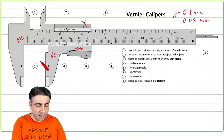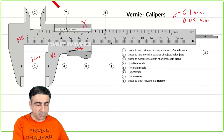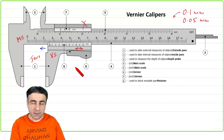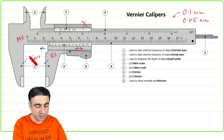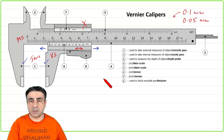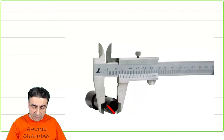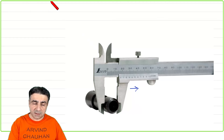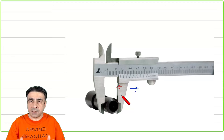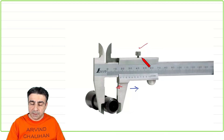These jaws — when you slide the Vernier scale to the left, the jaws are going to close and the gap between them will become zero when the two jaw tips touch. If you move it to the right, the jaws expand and you fit in the object you want to measure between the jaws. For example, to measure the diameter of a bolt, you slide the jaws out, place the object, then slide them back until the jaws hit the surface of the object. There's a locking nut and a guide mechanism.